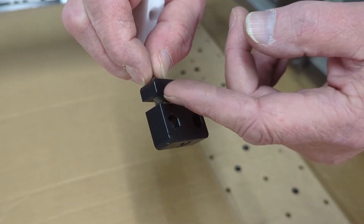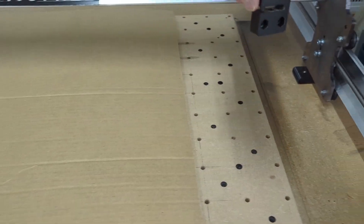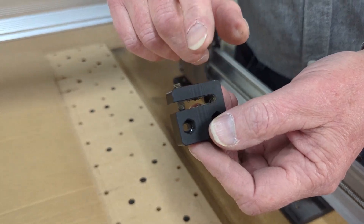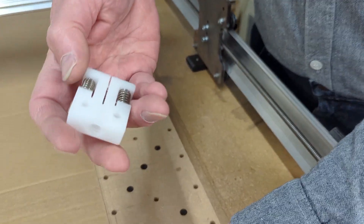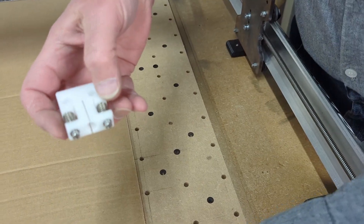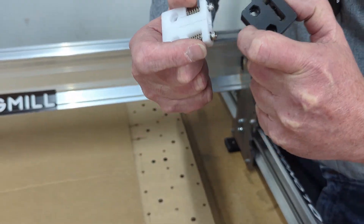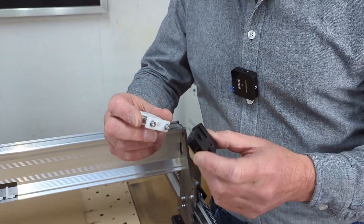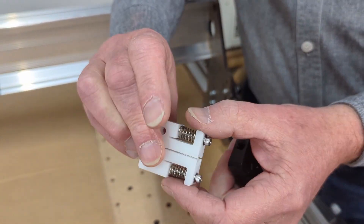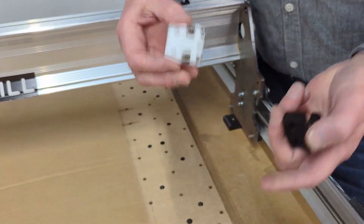When you have to tighten that up to take the slack out of the lead screw, LongMill has since improved these to this new style here. As opposed to the old fork-type contraption that pulls or pushes on the threads, this new design actually squeezes the threads together to prevent backlash.